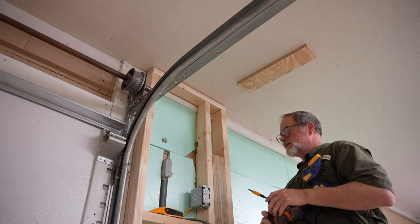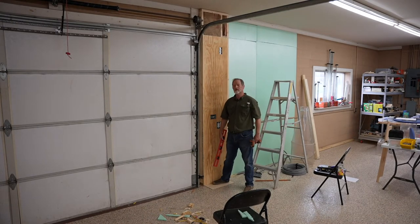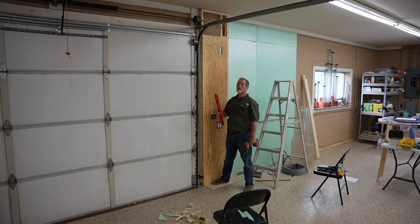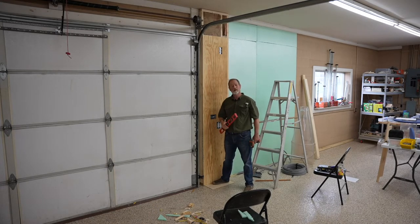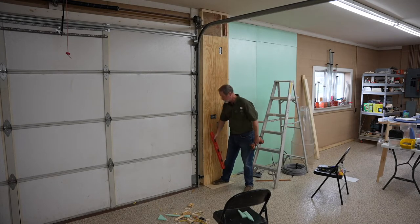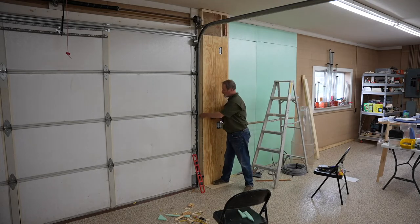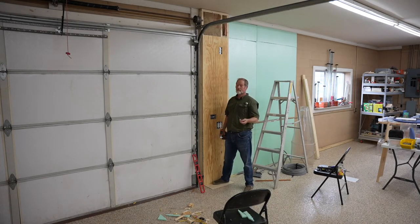Now we get to rearrange wires and get things put up, and hopefully a little insulation and plywood. Insulation is in place, and I've got a spacer down here below — a quarter inch of plywood. If there is any moisture on the floor, I don't want it wicking through this, so we're going to have a little bit of a spacer, and that will continue throughout. I have checked for square, and I am. That's important because as we move down the line, we don't want a gap to be shown. Every time we put a flat plate up there, I want it to line up flat on flat. I've got my spacer here with a couple of screws up there to hold it in place. These screws only go about an inch into the wood, so we'll have to put a number of them in. After that, it's just a matter of getting the covers on and putting the plugs in place.